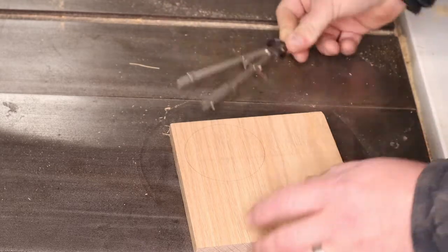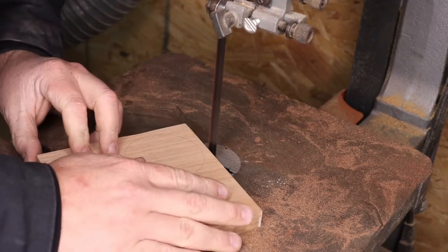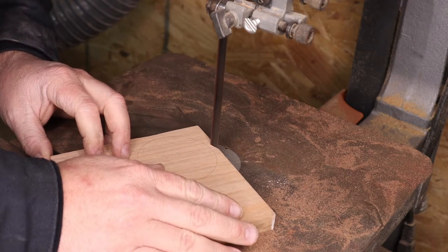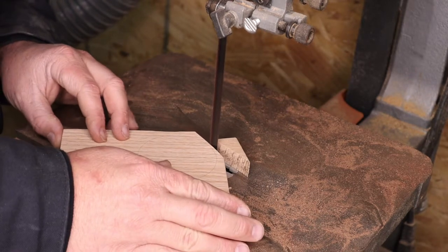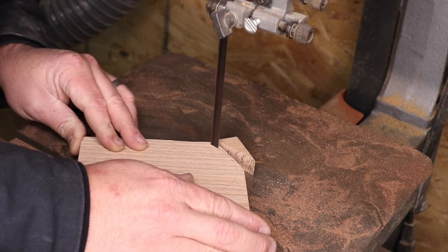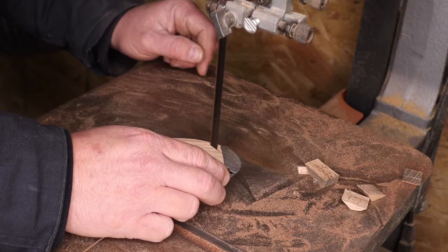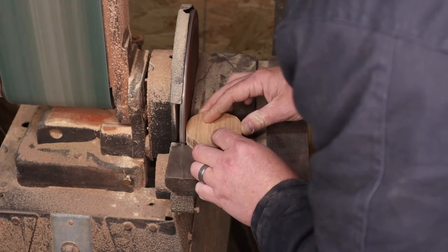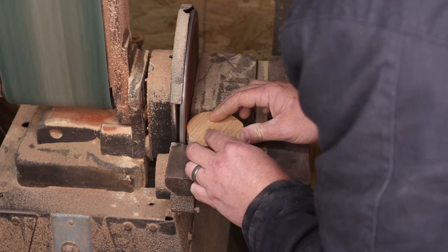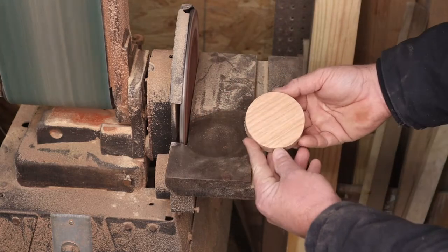Right here I'm just using my compass to make my 3-inch circle. Then I used my bandsaw to cut the circle out. I had a half-inch blade installed — it would have been better with a quarter-inch blade, but I broke my last one and had to make do. Even with a quarter-inch blade I'd still need to clean it up on the sander. I cut outside the line leaving the pencil line so I could sand right up to it for a perfect shape. Using my disc sander I went around the shape to get as close to the pencil line as possible, because any little deviation from a perfect circle will be blaringly obvious, so you really have to take your time and get this part right.